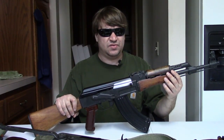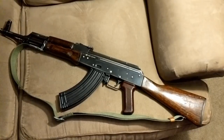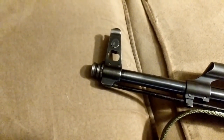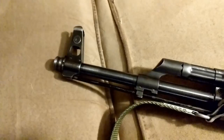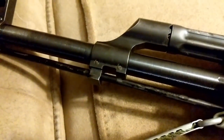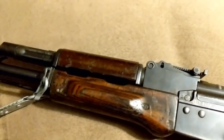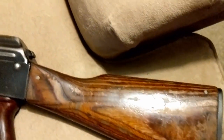The Polish AKM was a little different but also quite similar to the Russian. It has the 16¼-inch lighter-weight AKM profile barrel with 14x1 muzzle threads — original guns were still fitted with a muzzle nut. It would use the AKM bayonet lug under the gas block rather than the Type 1 lug under the front sight base, transition from a ported gas tube to a ported gas block, introduce palm swells for the handguards, and use an AKM-style buttstock with a tang on top and two screws — no tang on the bottom.